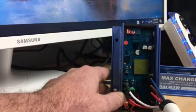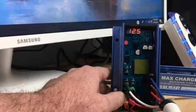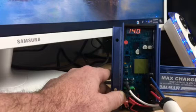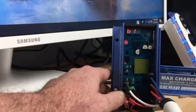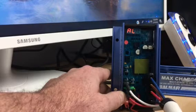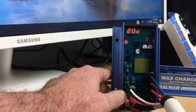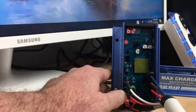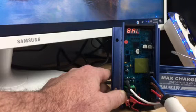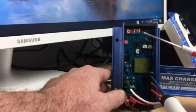Right now the regulator is scrolling through its parameters. For the regulator to be turned on, you need a ground connection, a 12-volt power connection, and the ignition to be excited. The number 9 pin on this side is the sense terminal — if that was unplugged it would register zero on the BV setting.